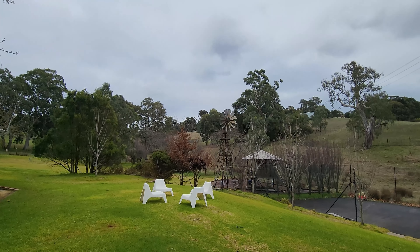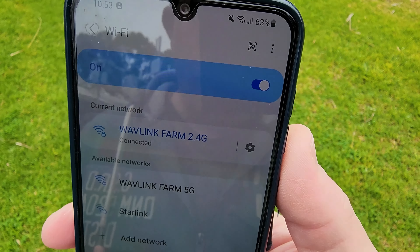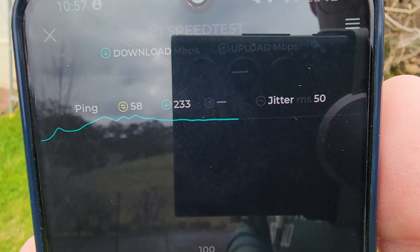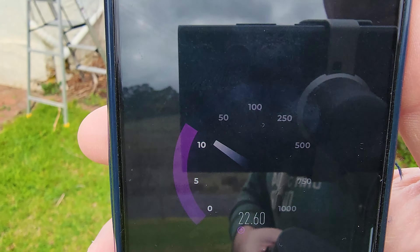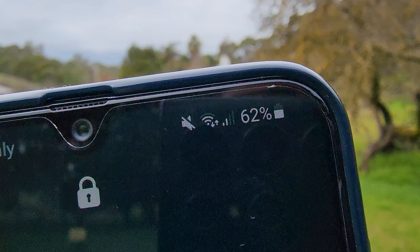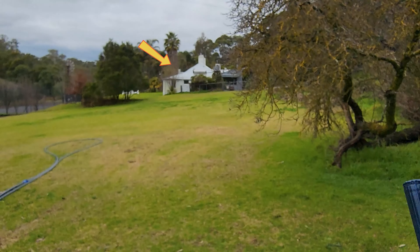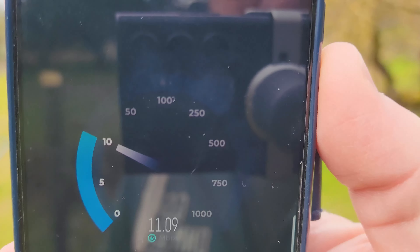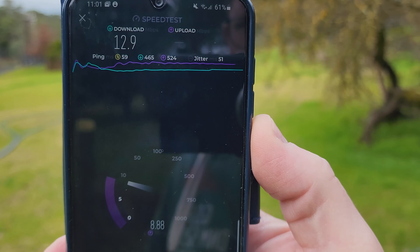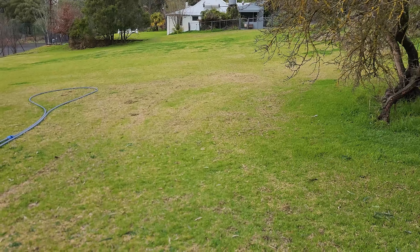We're actually going to do a speed test standing right next to the unit. You can see we're connected to Wavelink Farm 2.4G with full signal — getting about 28 to 30 meg down and a very similar speed up. Now we're about 200 meters away from the actual device. You can see three bars of signal still, and that's actually coming through a few walls. Our ping is pretty much the same, and our speed has dropped a little bit given the distance we are from the device — that can also vary with Starlink internet.